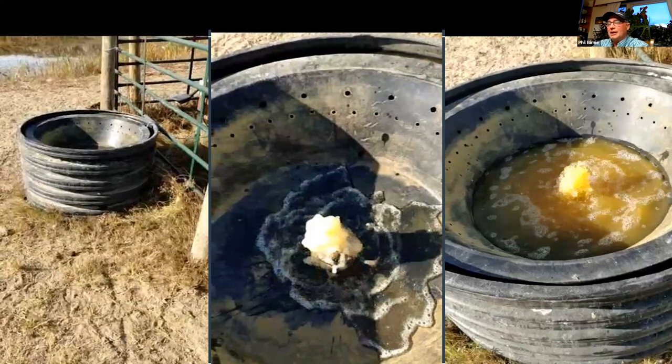One problem: the wet well wasn't dug deep enough - the dugout doesn't have to get very low before this system doesn't work as well as it could. They should have gone deeper since they're on higher ground away from the dugout. Behind the wet well and trough you can see four 10-foot green panels with the battery box and everything that operates the system inside. The electric eye is positioned halfway up between the fence bars, and at that distance the cows have to get fairly close before it turns on.